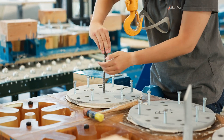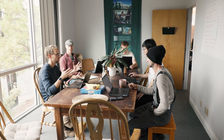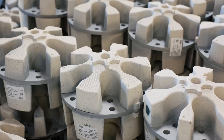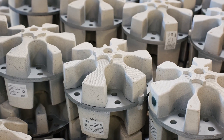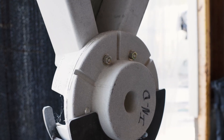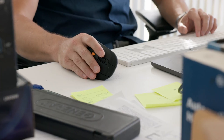So there's only one side that we can add features. And we take those concepts and say, how do we put all that together? If we have an open-face mold going this way, let's 3D print it and try that out. So we'll make a mold, cast some parts, and put them together on the mock-up. From that we learn to see how everything goes together and fits, and we can make rapid process changes there.